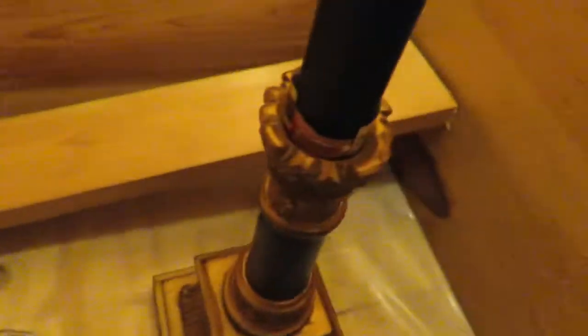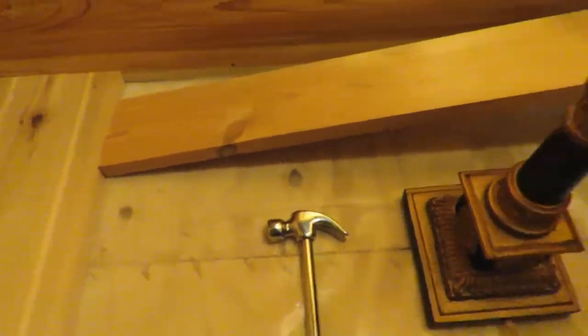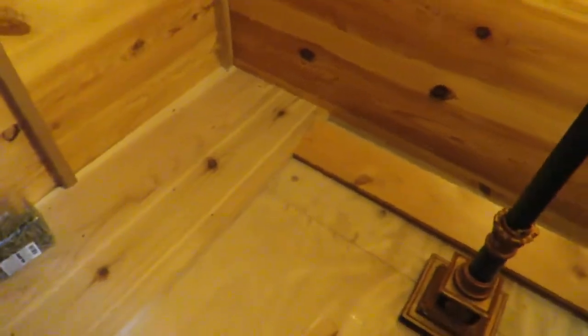This is the problem with not using actual tongue-and-groove flooring — even though it looks straight, this front board is warped. I got it in nice and tight and screwed one end, but then there was a gap. I measured the gap, measured the distance between there and the wall, added them together plus an eighth of an inch, and cut a board to fit. I pounded that down, closing the gap, then screwed it in. I'll probably have to do that on all of them, but I'll check back in later.